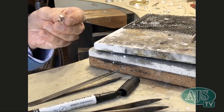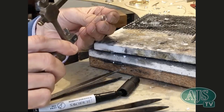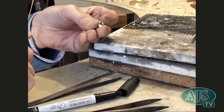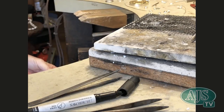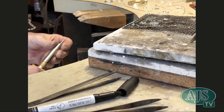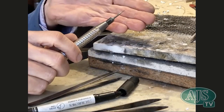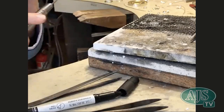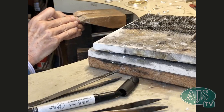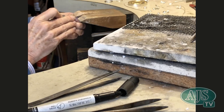And then I can go back into that with my saw frame and do the cut, which will open this up so that I can start burring it out to lay the wire in across the top. So we'll just do this together now, and then you'll understand why I'm doing this. I've already pre-prepared this one. I've cut that with the saw frame. I then use a nice fine parallel burr, a very fine one, and I'm going to go across that saw cut. Open that out enough for my wire, which is around about 0.8 mil, I think.